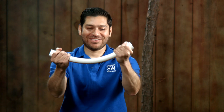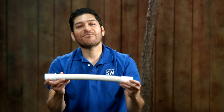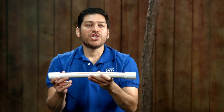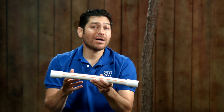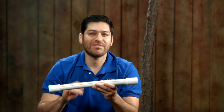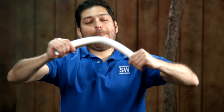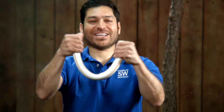So check this thing out — it's perfect for the repair I'm going to do today. It's made from flexible PVC. You can use it easily to go over bumps, around tree roots, over or under other pipes and around corners. It's capable of some pretty unconventional angles. If it's a little difficult at first, just leave it out in the sun for a few moments and that heat will start to make it more flexible for you.